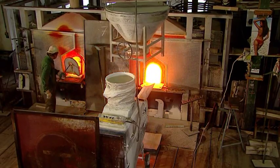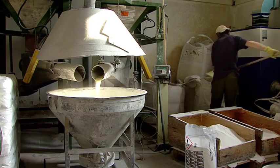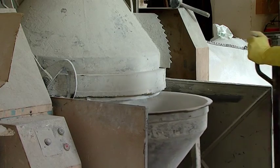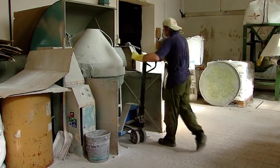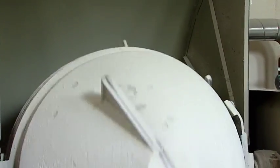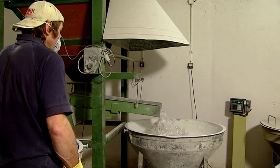Every glass batch contains the same basic ingredients: silicon dioxide, sodium oxide, and calcium oxide. Naturally, their exact ratio and composition is regarded by every glassworks owner to be strictly confidential. Apart from the father and the son of the Tom family, only the foreman knows this company secret. A mixture of glass pieces is added to the glass batch. It usually represents about 1/3 of the total batch amount.